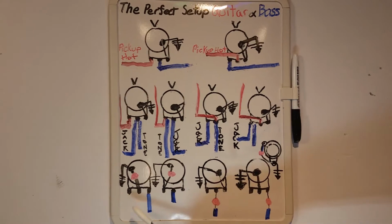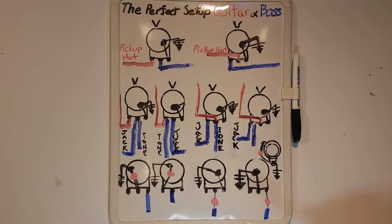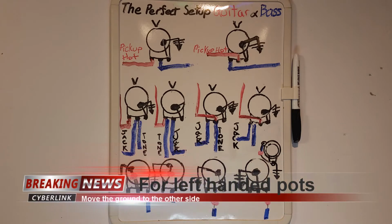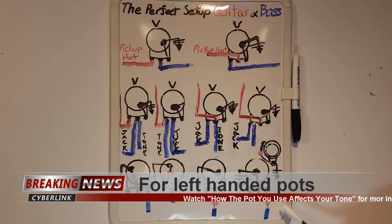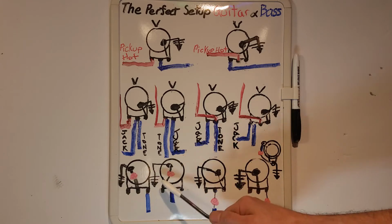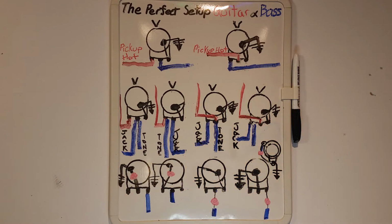There are four ways to wire a tone pot. The red dot is a capacitor. The first two ways are commonly used in Fender. The third way is the modern Gibson way, and the last way is vintage Gibson wiring. All four ways are electronically equal. Some people like to wrap the cap in foil to close it off in a Faraday's cage. The hot signal is partially open.